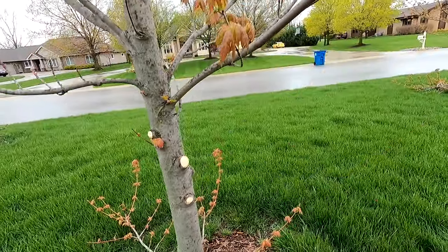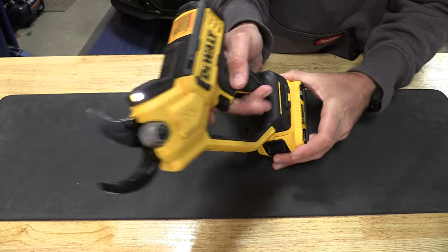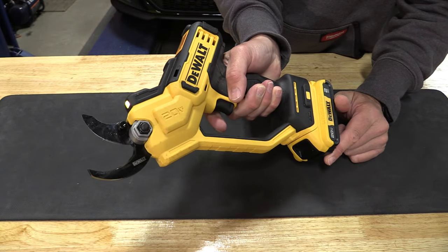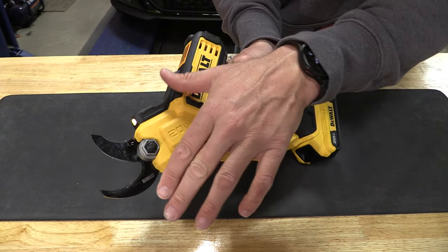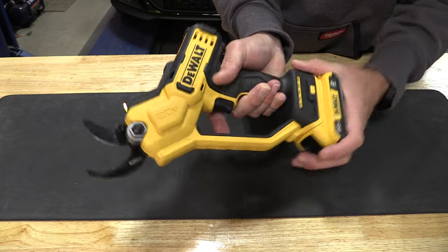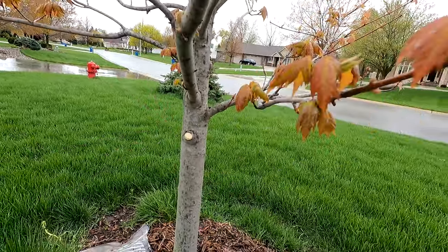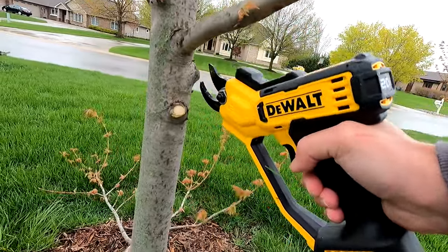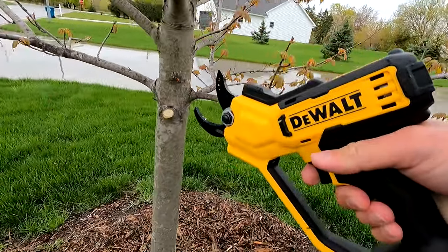There is a safety at the rear — you just pull down the secondary trigger and hold it back. At that point, the front LED light will come on and then you are able to pull the trigger and let loose. That will basically close the jaws based on the trigger position and hold them. Now if you hold this safety too long without the trigger going off, it will essentially lock out the jaws — you'll have to let the safety go and pull it back in. That is great because they want to keep your fingers out of those jaws, because it would cut them very quickly.